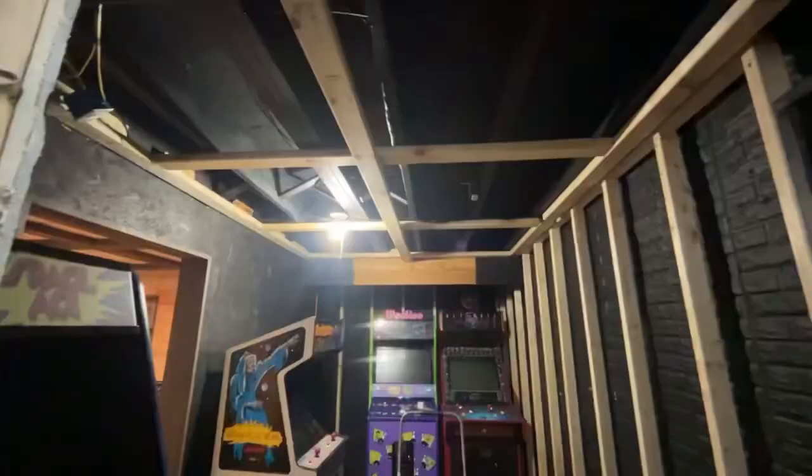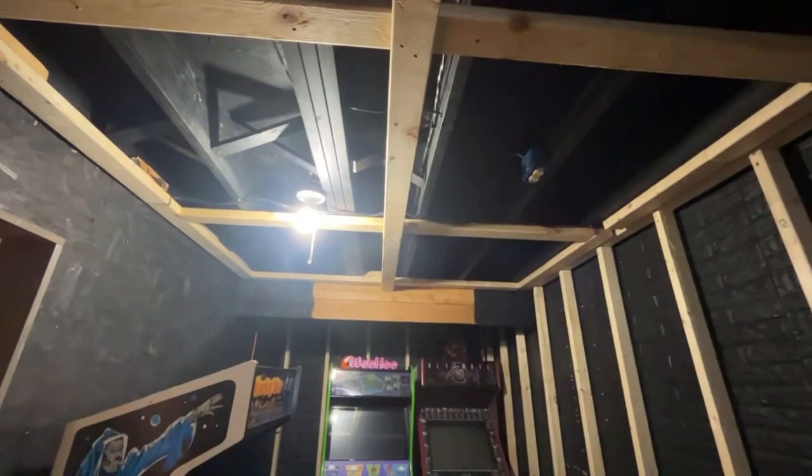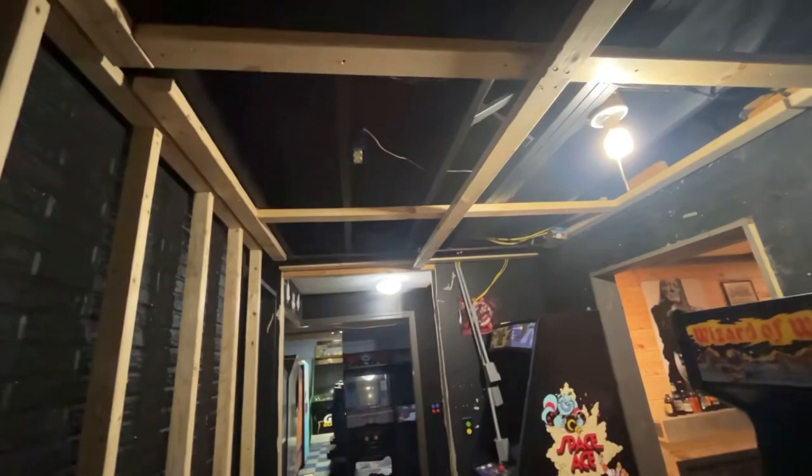That one is in now. That one's hanging lower than the other ones, but that is totally fine because we have to go three two by fours thick — there was no point in putting one above that one, just a waste of material and weight. Trying to keep the weight down as much as possible. This doesn't weigh a ton more than drop ceilings, but it definitely does weigh more. Now what I'm going to do is take two by fours from this point to the outside of that point — by doing that I'm overlapping that seam, which makes it stronger. I'm going to go ahead and put all those pieces in. The second layer will be done, and then we just need one more layer. Then all three layers will be in and the framing is done in this room — other than running the electrical.